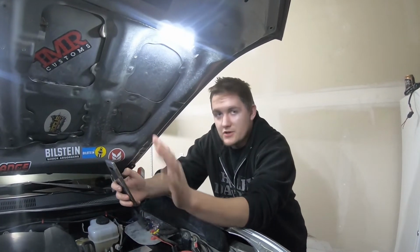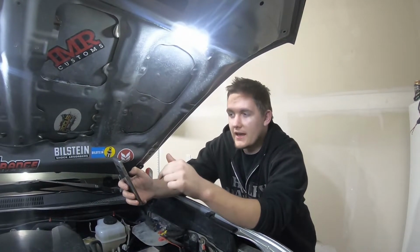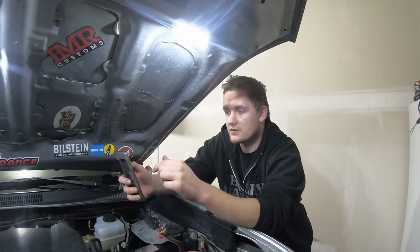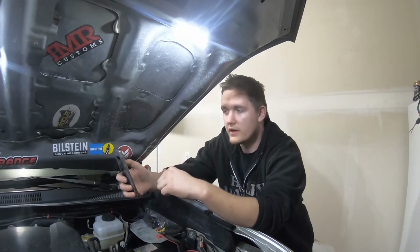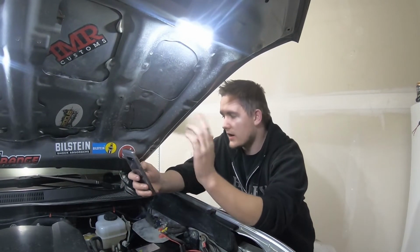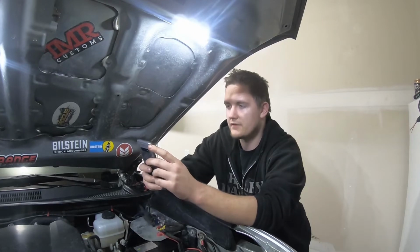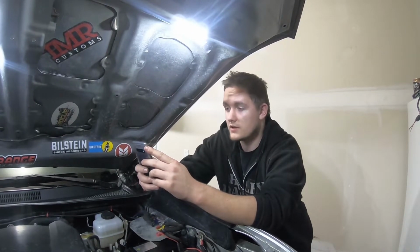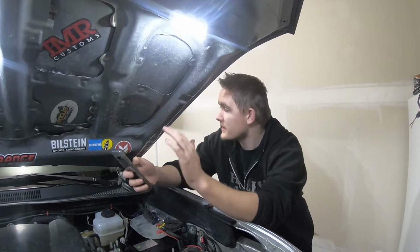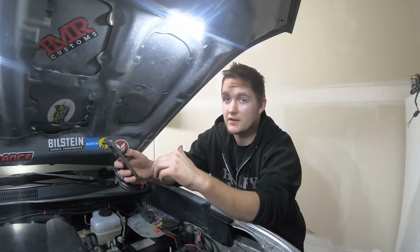Okay guys, just before the nighttime shots here, the quick math to this. Being that it's at 2.9 on the amps there, you take that times your voltage, which can be anywhere from 12.5 to 13.8, and the highest number we get is 40.03 watts. Divide that by 2, you get about 20 watts. But in the lowest case scenario, and also my amp reader is a little bit off, let's say 2.5 amps times 13.8 volts is 34.5 watts. Then you divide that by 2, you get 17.25 watts. So these are actually reading 17 watts a piece theoretically, and they are not drawing that much power, and the output, like I said, is magnificent.